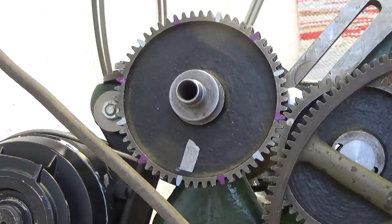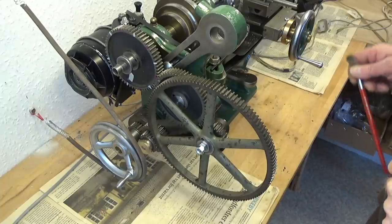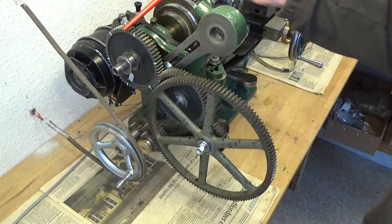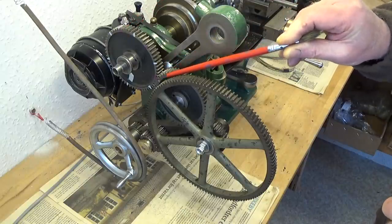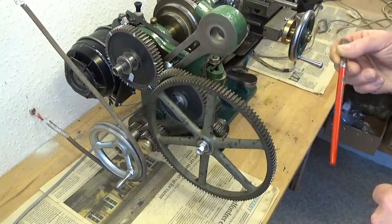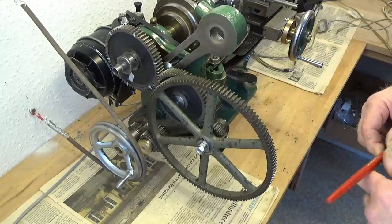But I will show you this in practice in a minute. To make worm gear teeth with the right cutting angle, the lead screw and the headstock spindle must be connected via gearwheels in the right ratio. This setup is for a 12-tooth gear wheel with a cutting angle of 17 degrees.